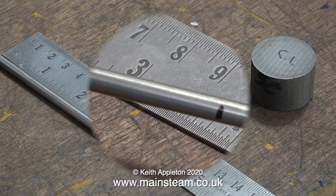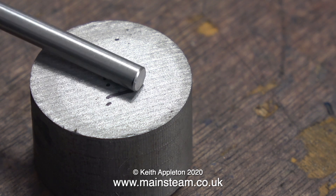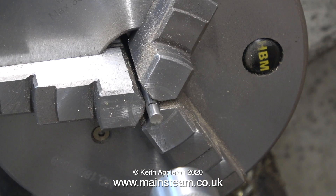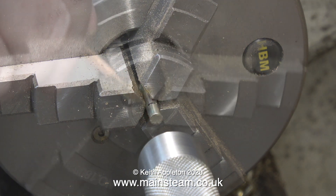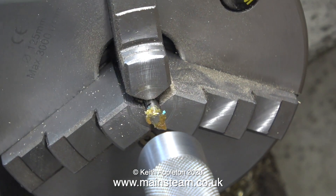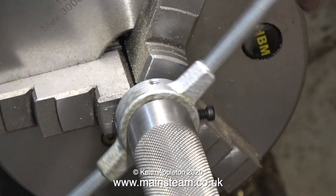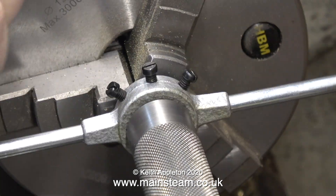The dimensions for this are marked on the drawing very clearly, but there was another piece of paper in the kit showing different dimensions — in fact there were a few such pieces. I really wish the manufacturers would not do this. I've cut the piston rod to the correct length anyway. Here's the part fitted in the three-jaw chuck and covered in cutting lubricant. I'm using my special homemade tailstock adapter, which keeps the die stock perfectly square to the work, and I'm threading the end of the rod.